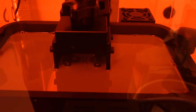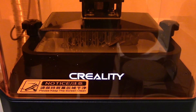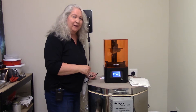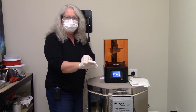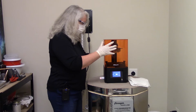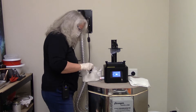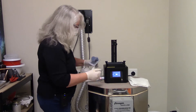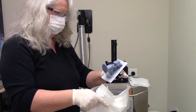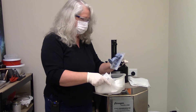This is what it looks like at 62%. It's risen out of the vat now, and you can see that it's attached properly to the plate. So it's 1:30 in the morning — the print just finished. It took 12 and a half hours. I've got my protective gear back on and I'm going to leave the ventilation on until I take this lid off and let the smell out. It looks pretty good. I'm going to take it over the table and clean it the traditional way — with isopropyl alcohol.